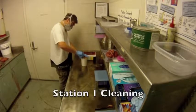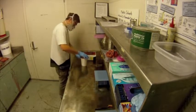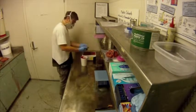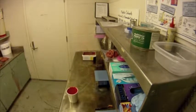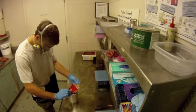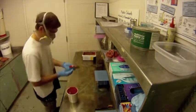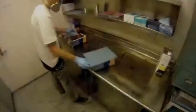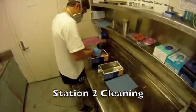Once you are done spraying and recoiling up the hose, bring the gun over to the assembly area. Prepare 3 different acetone baths. 2 baths are prior used acetone, and the third is slightly used acetone. Begin by dipping each component of the gun into the first bath of acetone, which is the already used acetone, and clean thoroughly with an acetone brush.